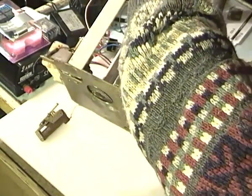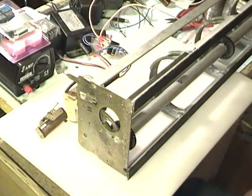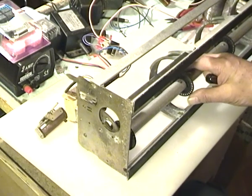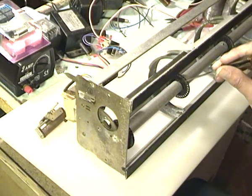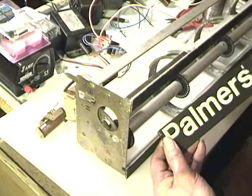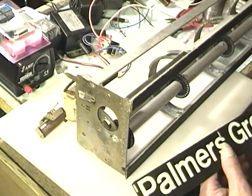If we turn it round and look at how the flaps are connected — due to the fact that I am working on the motor at this end, this unit is now actually upside down and this is the top. The flaps are inserted into the unit into these discs, and these discs are driven by a peg on this shaft. Each disc has 30-odd slots, the far end of each slot being a circle. The flaps have a section cut out in them, with a piece remaining which enables the flap to rotate within that circle at the bottom of each slot.